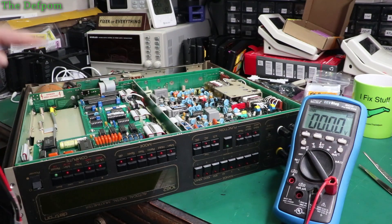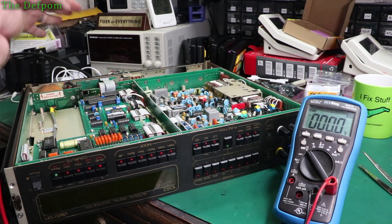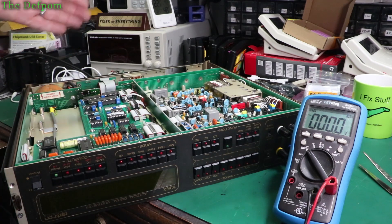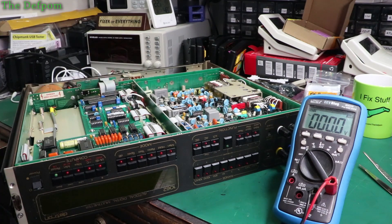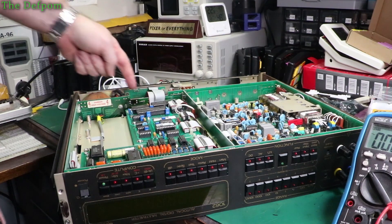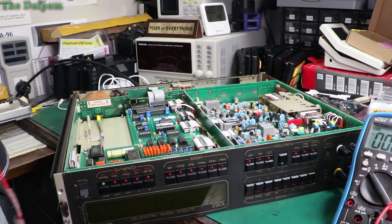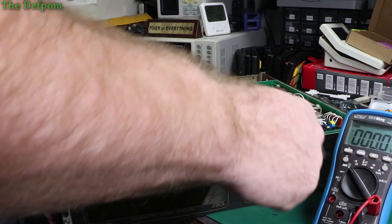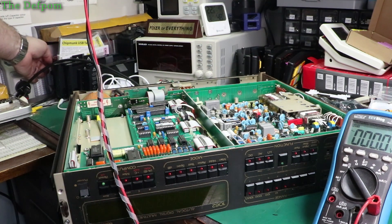I've flipped it over and left it to cool down a little bit. I'm going to do some voltage measurements on this last rail and see what we get on that capacitor. I'm mindful there could be a rail loading it down - could be a short somewhere which is then overloading the transformer. I didn't notice what my wattmeter was saying as far as current goes. This capacitor here is supposed to be feeding the 5-volt rail with the infamous LM309, which can apparently be a problem. I'll do AC measurement first then DC, but I'm not going to do it for very long as the transformer is making a bit of a noise.